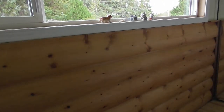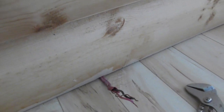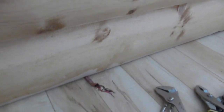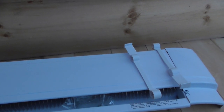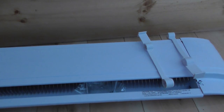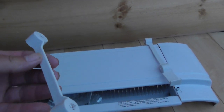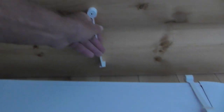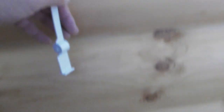Welcome to my bedroom. This is the wall I'm going to put it on — this is where we had an old baseboard heater, but it was kind of a real power sucker. I've got my AWG 12 gauge 240 line coming in, and this is my 240 volt new Dimplex heater going in. These heaters heat 40% faster and are 60% more efficient than a regular heater. They come with little feet that mount onto the back of the heater to offset it from the wall by one inch, which gives it a cooling factor in the back and prevents the wall from getting too hot.